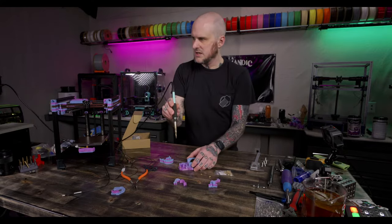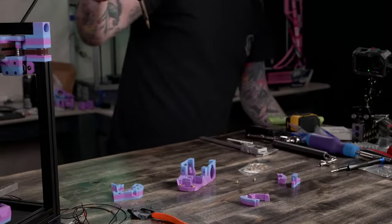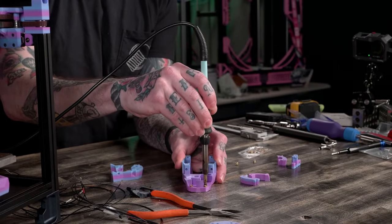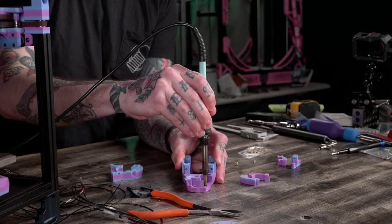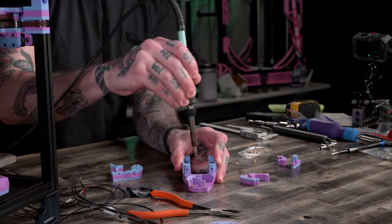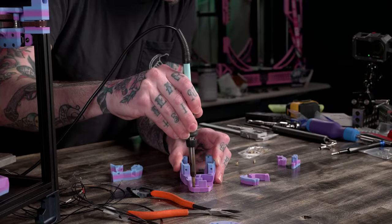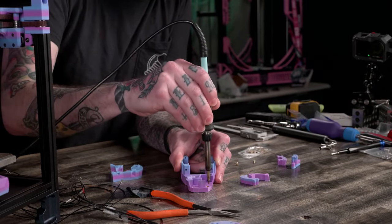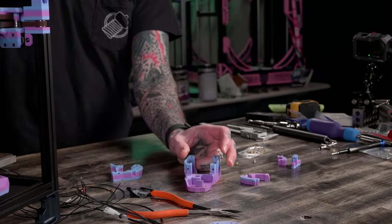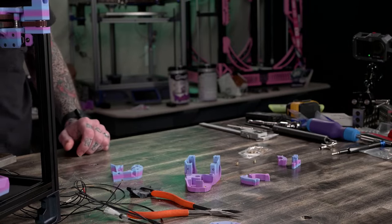All right, heat insert time. Take the table up a little bit. Yep, there's my insert tool rubbing against that flange I was talking about. This one has enough space, but that one doesn't. It's almost difficult to get it to go in straight. As a result, I drop my soldering iron. Exactly why I didn't want Gene up here.